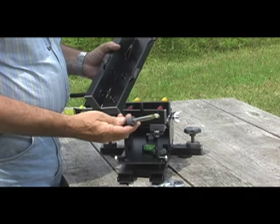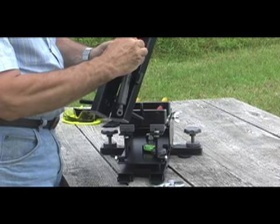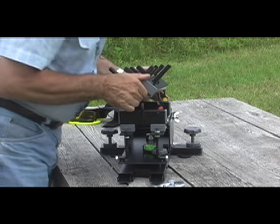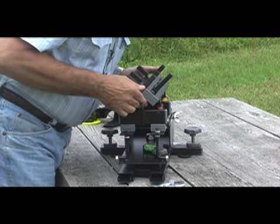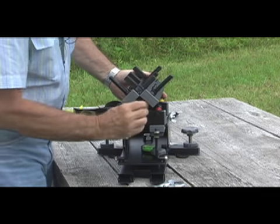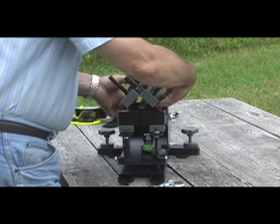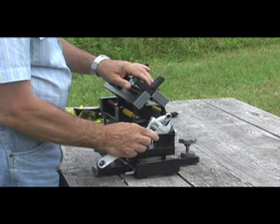To replace the carrier assembly and the damper, first mount the shaft end of the damper to the forward mounting stud on the carrier and tighten the nut two complete revolutions. Supporting the damper with one hand, engage the two forward tubes over the two forward pins about one quarter of an inch. Once you do that, the two rear tubes will drop ahead of the two rear pins and you can push the entire assembly back against the spring tension. Put the eye of the damper over the mounting stud, put the nut in place and tighten it. Then tighten the forward mounting nut on the damper so that it is flush with the end of the stud. Put your retaining nuts in place and you're in business.